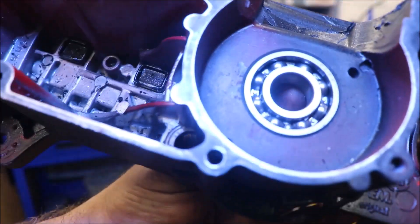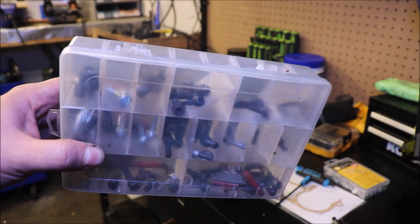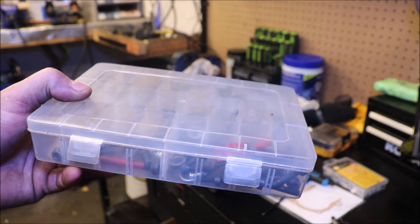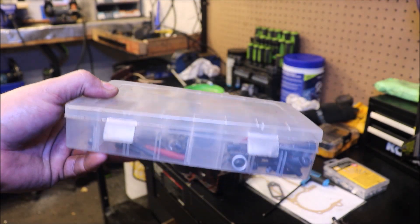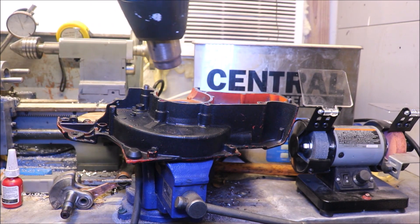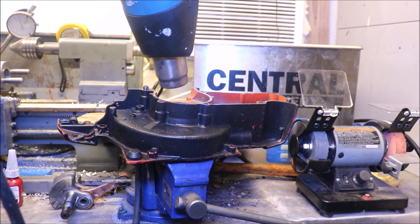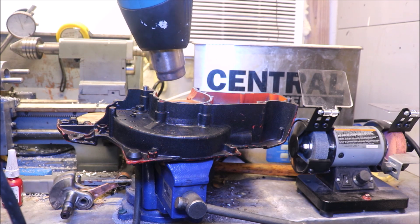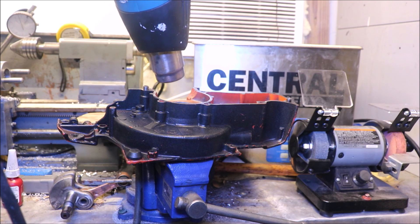There it kind of fell in. And there we have it. She's in there — she's a little warm, but she's in there and spins freely. I'll select bolts and screws from Farmer Tech or wherever you choose to buy it from, for the 365/372 saw. You don't try to heat the center of the bearing, although we are using a heat gun. It's not like you're going to screw up anything. And this is a metal cage bearing, so it should be okay.